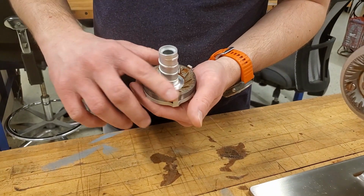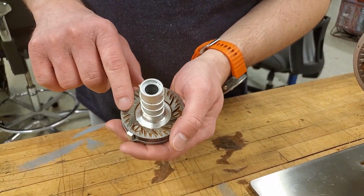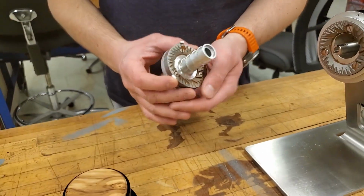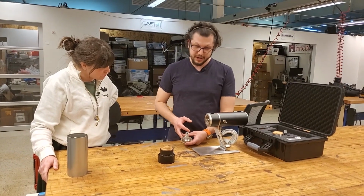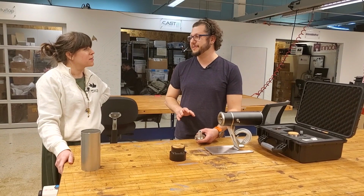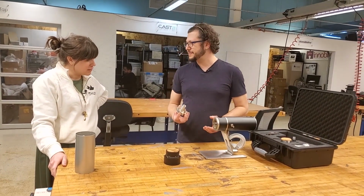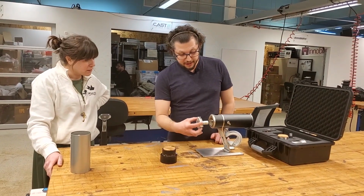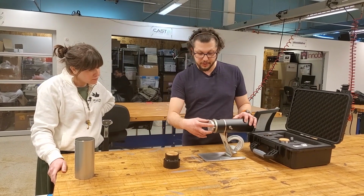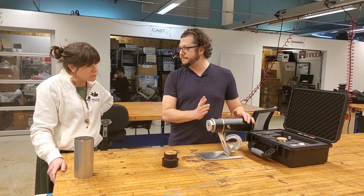Yeah. But yeah, this guy pre-crushes the beans and then they go into the blades. So these blades are actually the newest by SSP. We ordered these from Korea from a gentleman named Hansung. He's a really cool guy. He really knows his blades. They're called burrs, and these are in particular flat burrs. Okay. For a flat burr coffee grinder, one of the things that is super important and super critical with the Zerno is that your burrs are aligned perfectly.